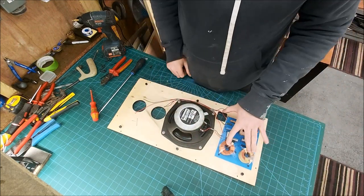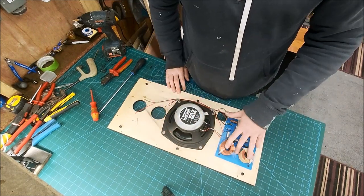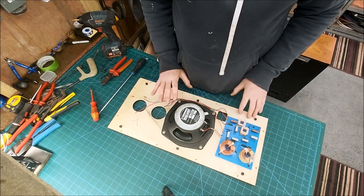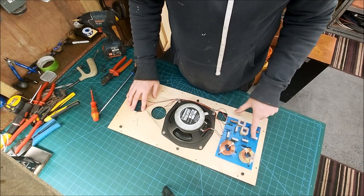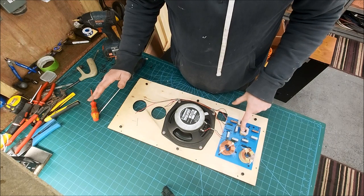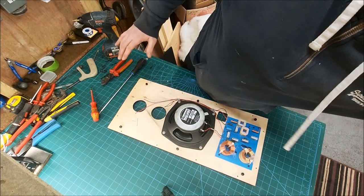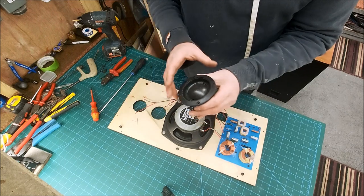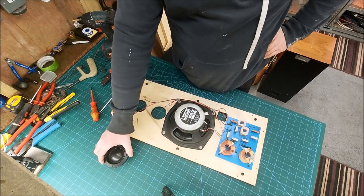So the crossover - we could retain it, but like I say these values are all going to change. I think we had a fourth order arrangement on the woofer, which for a three-way design is probably what we're going to end up with. We had a third order on our super tweeter and third on our HF1300. But the HF1300 was allowed to play up as high as it could, whereas with a mid range we're going to roll the top off. Given that the dome on this is very very small, we can probably just roll that off with a first order slope - not too aggressive. So integrating this is probably going to be pretty good.